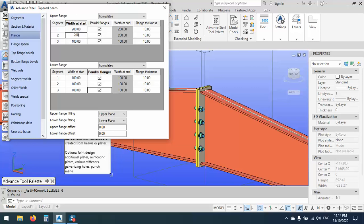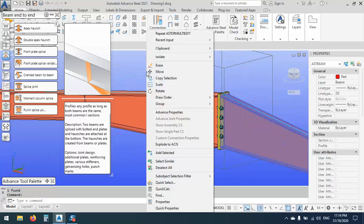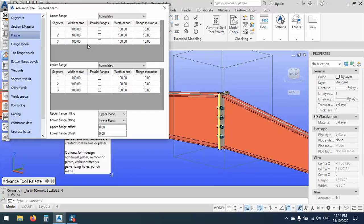Also the rest of the problem with the beams here — just right click, then go to Advanced Properties, and go to Flange. Here we have flange of only 100 millimeters. I will make it just like the column, which is 200 millimeters. Again 200, and again 200. I have this problem and again for this one I have to make it the same thing. The same problem with this one. First I make parallel — otherwise I have to change on both sides. So I will say 200, 200, 200, 200.